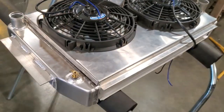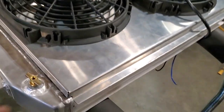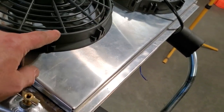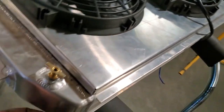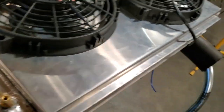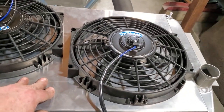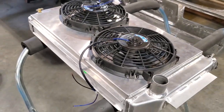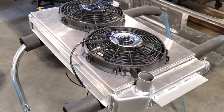These are great to have on a lot of vehicles. Now he's drawing air from here. Because of this 1 inch space up here, everything is going to have to pass through the fan. So air coming in through the front now is going to be forced to go in here, so it's going to cool the radiator even better. As always said, fan shrouds were always much better, right? But that's a quick little one. Simple little fan shroud you can make.